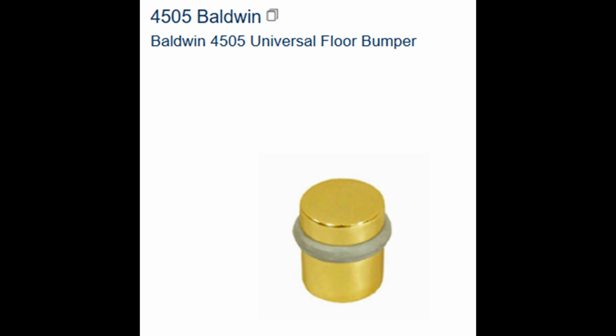While that's a problem, the actual paramount problem is it would not be permissible to do this modification work in the field per NFPA 80. I'm not the code police, but I'm merely saying that if you did the work and something happened, and I don't mean a fire, something really bad, somehow the door supplier finds out that this field modification was done, you no longer have a fire door. Right. And it's complicated.